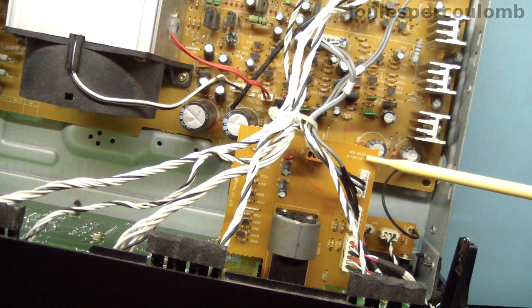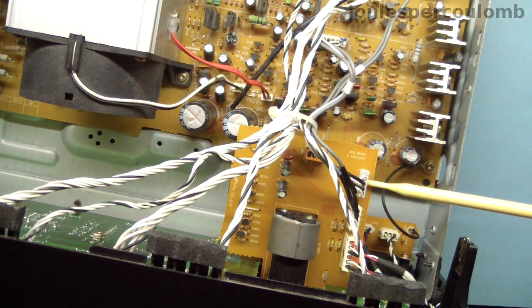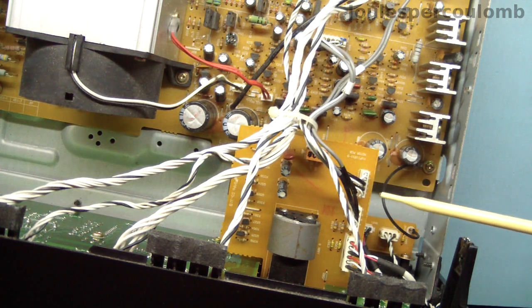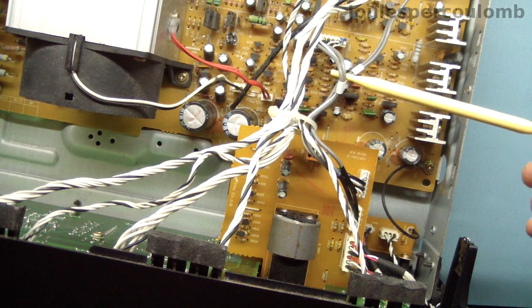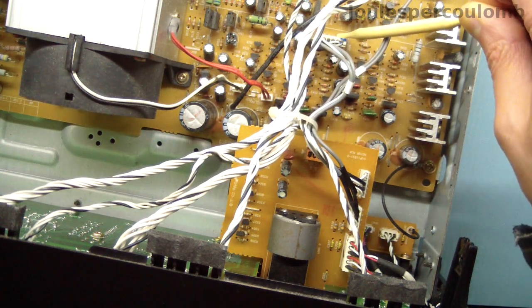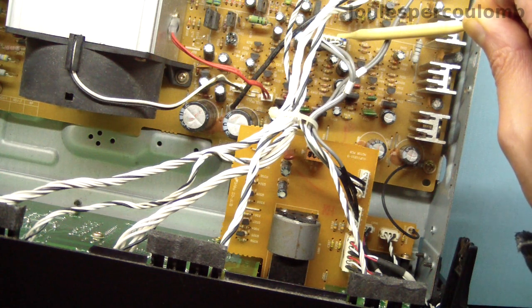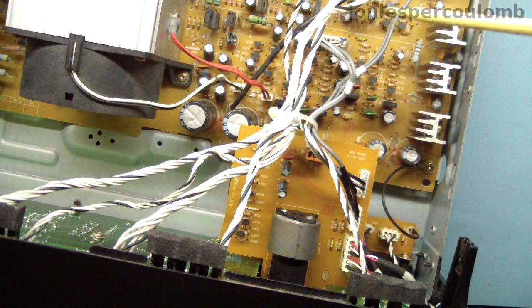This is the volume control circuit board. Audio signals enter it via this connector here and exit it through this one. On the circuit board, the contacts are labelled L, G, R, G and 5 volts. They're connected via this bundle of cables down to here, where the contacts are labelled from left to right R, G, L, G and 5 volts.